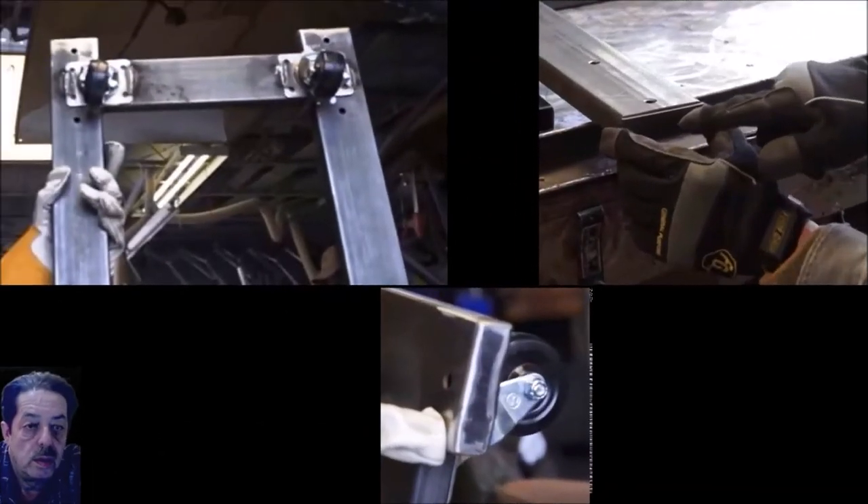Let's take a look at where he welded these casters onto the bottom of that dolly. He drilled holes through it above and below because those will be bolt holes that are going to hold his platform on, whether it is metal or whether he's using wood. People sometimes use these plastic end plugs for rectangular steel. You don't have to — you can use half-inch wide or one-inch wide, whatever you find in the scrap bin. Weld it onto the ends.